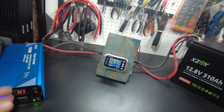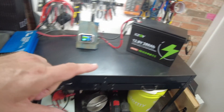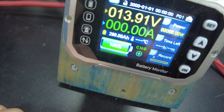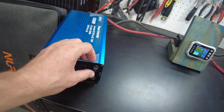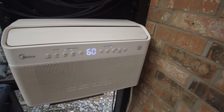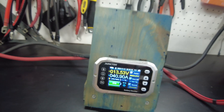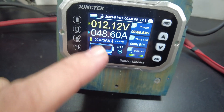We're still going — it's got some left in there, no doubt — but I'm going to kill the test because it's not going to tell us any more data. Now I've got the 280 up on the bench for a capacity test. I changed my shunt to 280 amp hours so the percentage meter will be correct. Let's turn the inverter on, then the air conditioner. We are pulling some watts — looks like we're getting a little higher wattage today because it's a bit warmer.